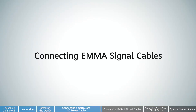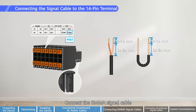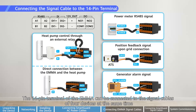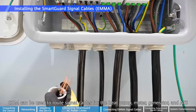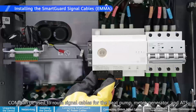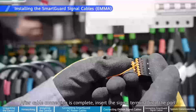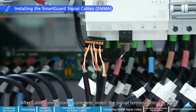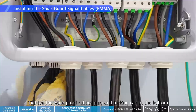Connecting EMA signal cables. Connect the EMA signal cable. The 14-pin terminal of the EMA can be connected to the signal cables of four devices at the same time. COM can be used to route signal cables for the heat pump, meter, generator, and ATS. After cable connection is complete, insert the signal terminal into the port. Tighten the waterproof rubber plug and locking cap at the bottom.